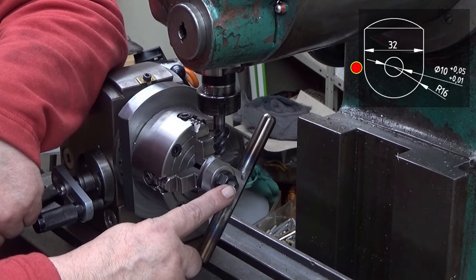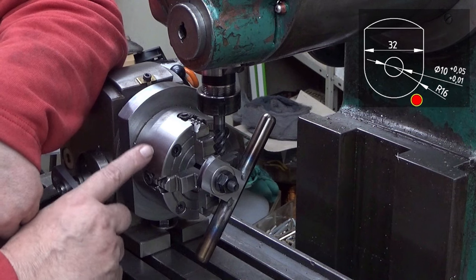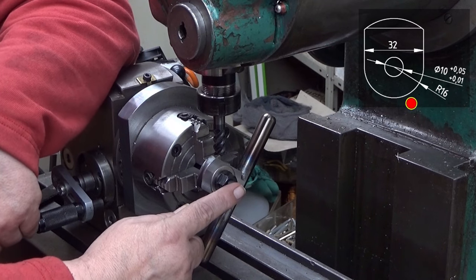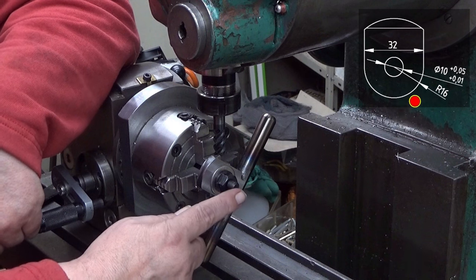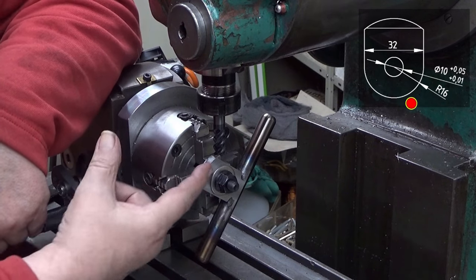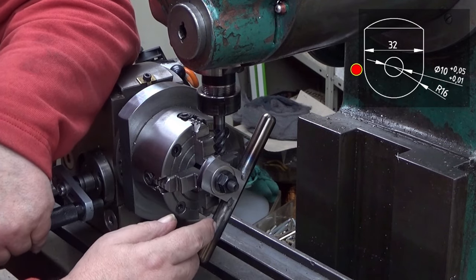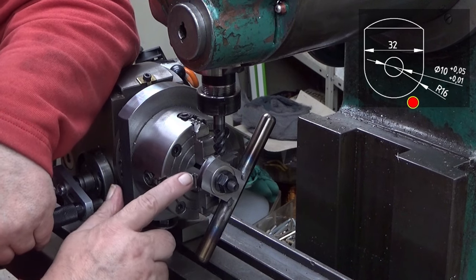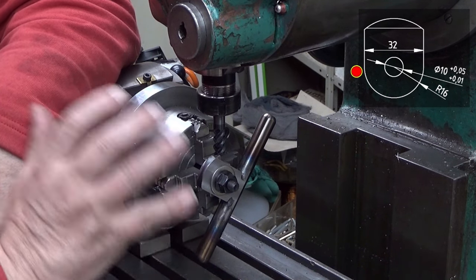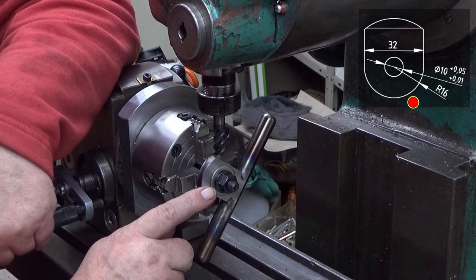So what I have done here, there is a bolt, and this is a long one, so it goes right behind the jaws. So the cap of this bolt is behind the jaws, and it's centered about in the center. I didn't dial it in, just visually check that it's okay. And how do you check it visually? You use these lines here and see that they are about the same distance from that line. So yeah, it's center enough. And I can also see when I now touched it that it's quite symmetric here. That's really, really good. It's not in the center, but well, it's center enough.